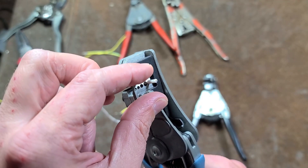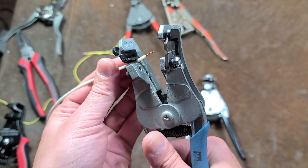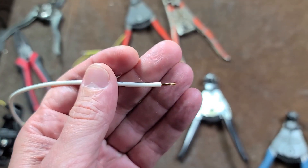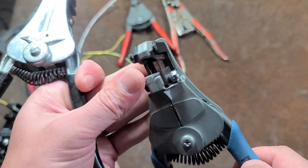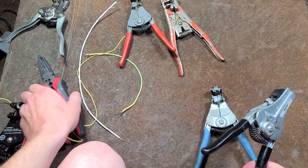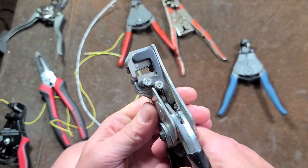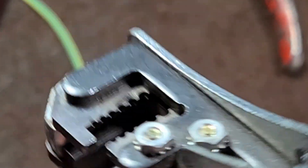The second issue is because it's just sharp blades with nothing really forcing the wire to be centered besides the blades clamping down through the insulation. If it's offset to one side, as soon as it hits the conductor, it kind of pushes the other side of the wire down. Generally speaking, these things work excellent and basically don't cut any strands, even though they technically touch the wire a little bit. Now to give you a quick zoom in, since these jaws are just the same type of jaws as in these, just in an automatic system.